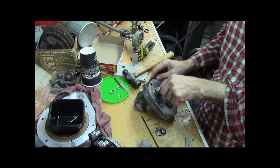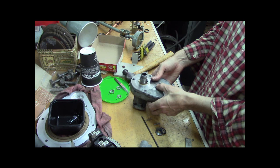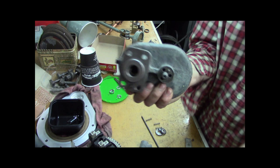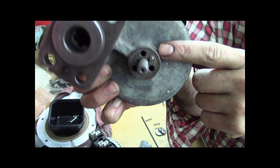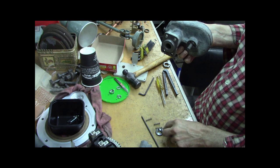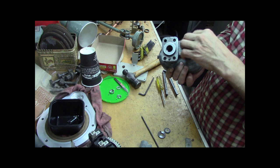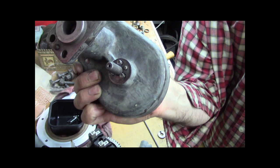Okay, here's that shaft, look at that shaft. That's cool, that's how that works. All right, so no oil, if oil gets in there, it just kind of assumes its own level. Now, with the back of that, there's a pin and three recess holes, okay? So that pin, well, first of all, these springs go in them holes, okay? One, two, three, one, two, three. There's the springs in there and then the pin.